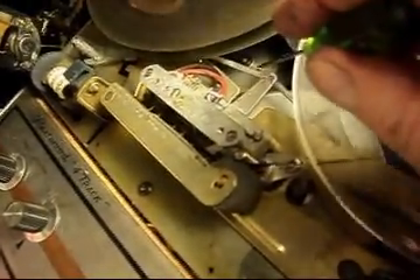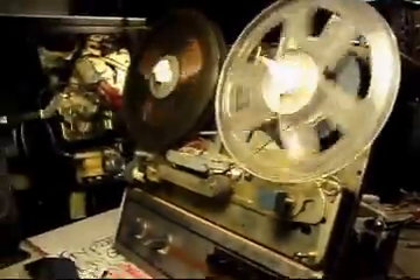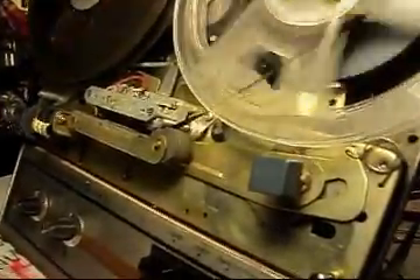The really biggest issue is this wheel right here — they're both pretty hard. This one's for rewind, this one's for play, and they're both really hard rubber. I reconditioned them by sanding them. It just got it working, but I don't know if this motor's going to stand up. The mechanics are still a little sticky. I tested the tubes — they were all okay. Cleaned the tube sockets. There's some retro tunes playing — this thing probably hasn't played in years. I cleaned it all up. That's the best I can get it going at this point. I'm going to have to try and source those two wheels, though. Good luck on that.